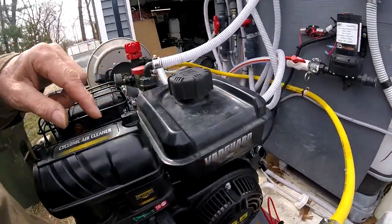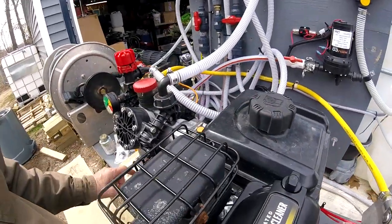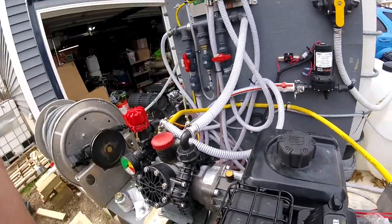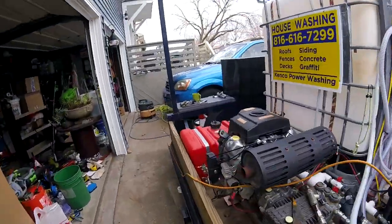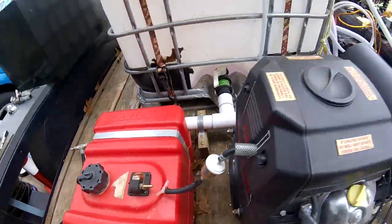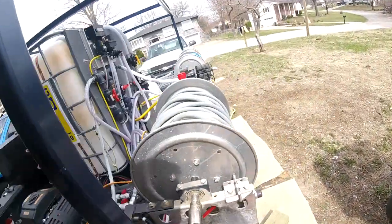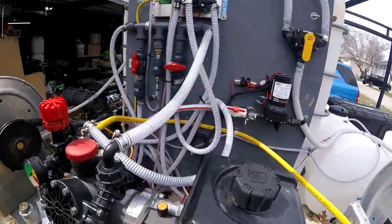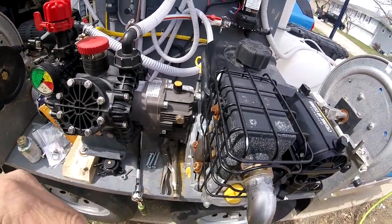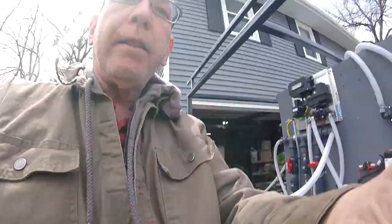In this video, we're going to eliminate this small fuel tank and add a diaphragm type pulse fuel pump, hooking it up to the 12-gallon fuel cell via a Y fitting. We'll put an inline filter in, and we need to pick up a port off the engine to grab the positive and negative pulses off the motor to operate that fuel pump.